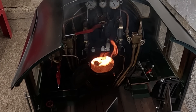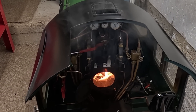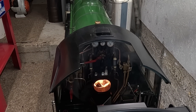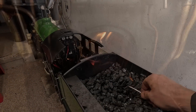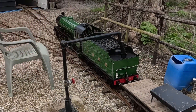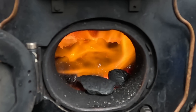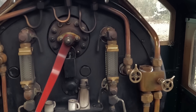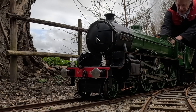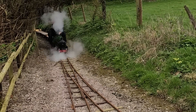I've just lit the fire in Bongo for the very first time in 2024. Some charcoal burning and a little bit of smoke, so I'll shut the fire hole door. It's not making much heat yet but we're getting there — I'll put some more coal on. Here we are filling the tender with water from the little water tower. The coal's burning properly now, about 40–50 psi. We've got pressure up now and I'll head off down the line to where I've been working on the embankment.